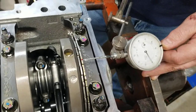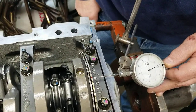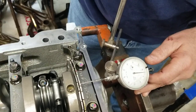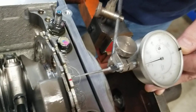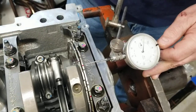There's another bent tooth — this one's eleven thousandths to the front of the motor. There's another bent tooth — ten thousandths to the front of the motor. The third bent tooth: ten thousandths to the front of the motor.